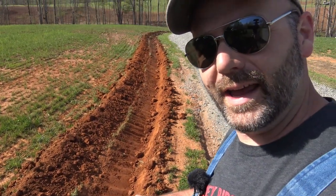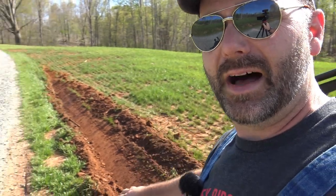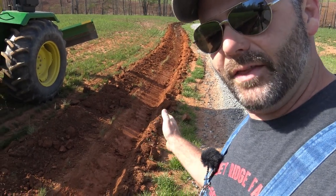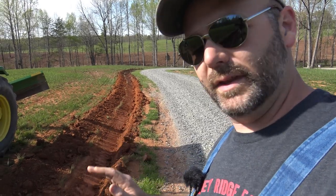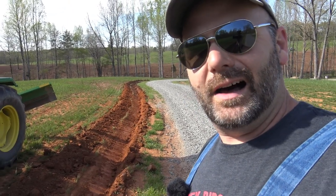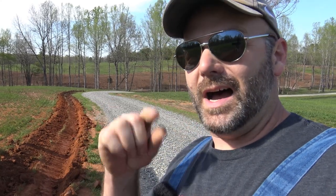So this is the ditch that we've cut and it only took three passes. I progressively worked my way down in here. You can see it's made a nice dirt pile right here. We also want this side to progressively roll over that way and this side to be smoothed out over the hill. So we'll adjust our blade, come up the driveway this way and throw the dirt that way, then turn the blade around again and pull more dirt back up this way. We'll drag it nice and smooth and level so there's a nice roll in for mowing and a nice roll out for mowing. Then we'll get the seed drill and drill this area down with grass seed — we'll show you the seed drill in a future vlog. Lots of work going on on the farm here.